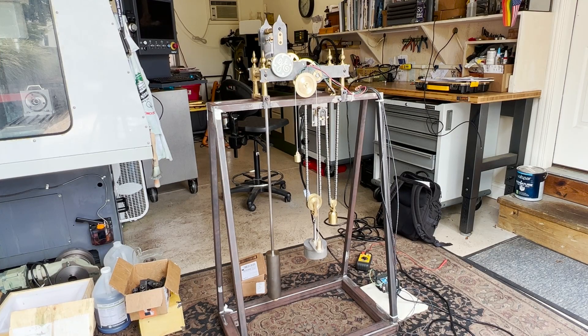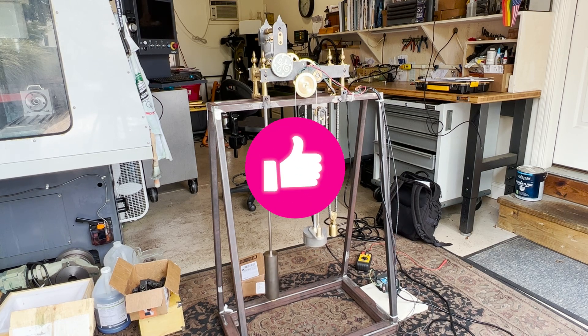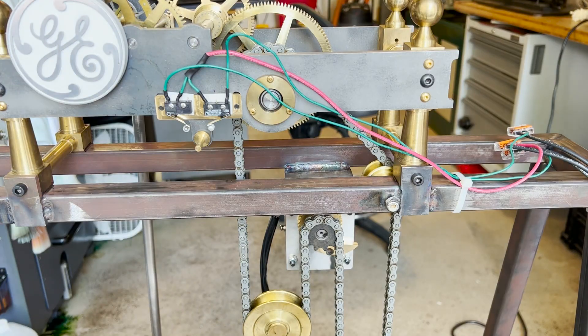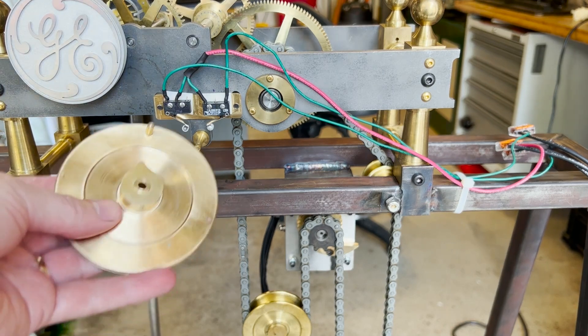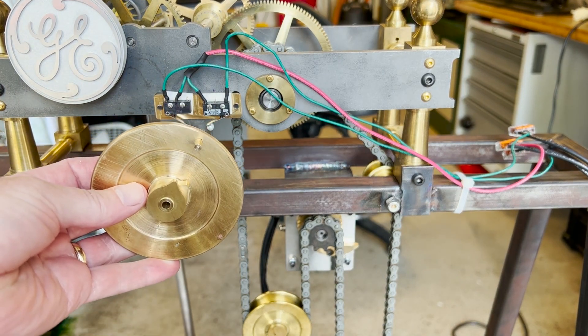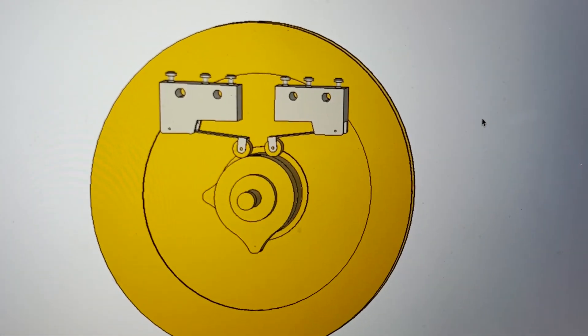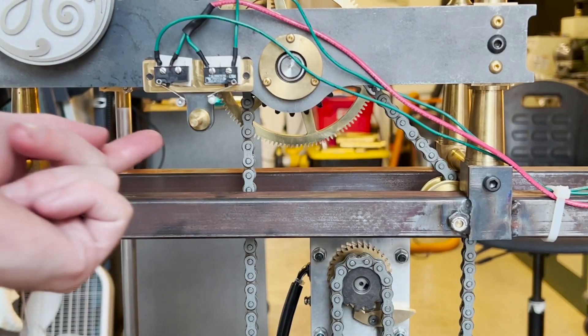Here's what I've done — you can see this operating. This is winding the clock up, and when those little weights hit a place on that wheel that's spinning around, it'll automatically stop. It's really just a start-stop button that would be on a typical motor starter. You can see me exercise the start and the stop, and this follows that circuit. I've got cams here that are what turn those little switches on, and you can see how they ride.